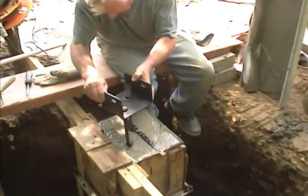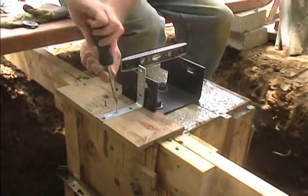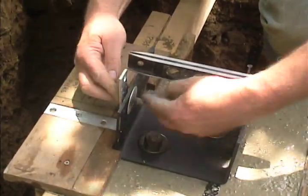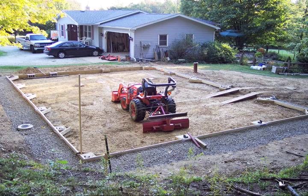The LumberLink base plate has 12-inch J-bolts that are pushed into the cement. Chuck made a simple jig, mounted it to the form board, and then fastened it to the base plate, keeping it firmly in place while the cement dried. The pier forms had notches in them to receive the outside form boards. The foundation was now ready for the frames.